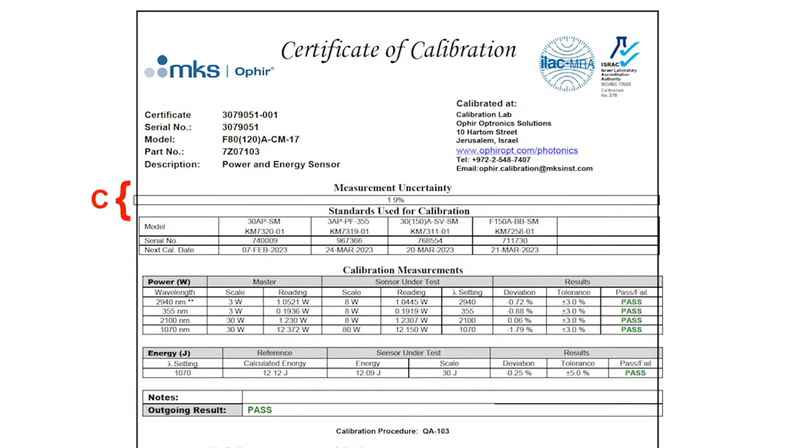Region C: Measurement uncertainty. The measurement in this case is the calibration — the process of comparing the reading of the device being calibrated with the reading of an accurate calibration master. In the ideal case, the calibration master would be errorless, noiseless, and absolutely correct, in which case the measurement uncertainty would be 0. If the measurement uncertainty were in fact 0 and the calibration result — the measured deviation between the device being calibrated and the master — were, for example, 1.5%, then we'd know with 100% certainty that the device being calibrated was off of the absolute true value by 1.5% in that particular measurement.